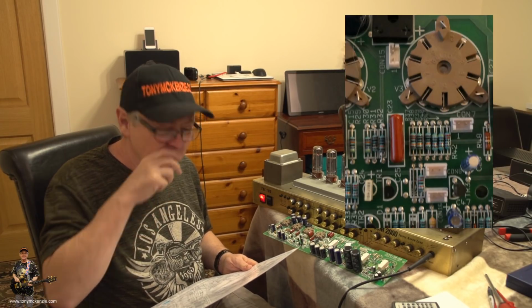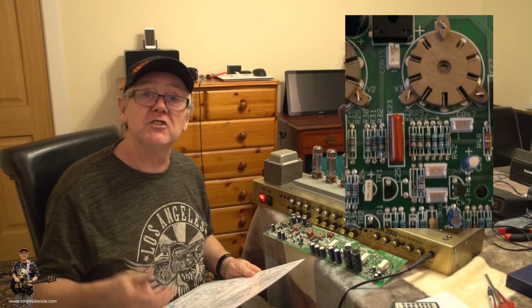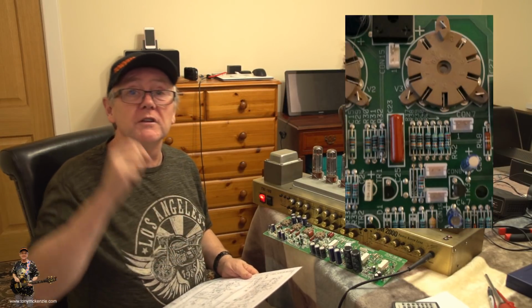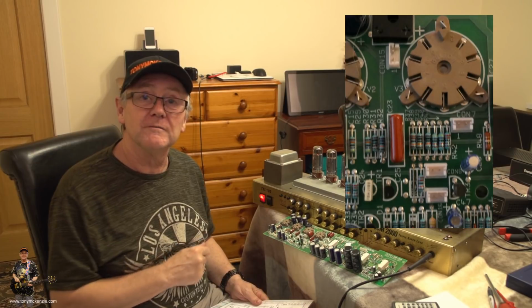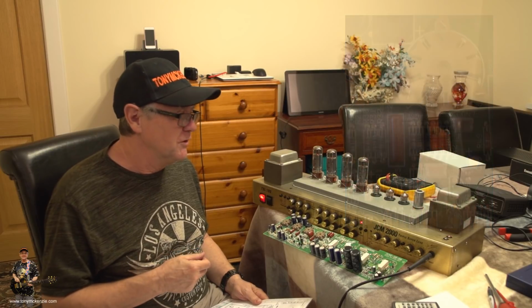I've got an itch on my nose. Yeah, connection 16 is also, it's a sort of in parallel connection to connection 8, so you don't really need to do anything with that either. So those two are two connections on the board that you don't have to do anything with if you're on a TSL100 JCM2000. That's cleared things up a bit, hasn't it? Now you'll be able to make it just work.